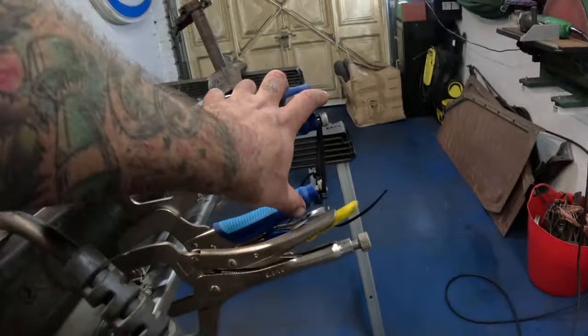That's that all welded up in 2-inch stitches like that. See, they're not the prettiest welds in the world, but that's not what we're going for, because we know they're getting sanded off anyway. What we're going for is getting a good even heat distribution and the weld to penetrate, yeah, all the way through to the other side, which is done perfectly. So now I've got the really tedious and filthy task of sanding off the top of all of those.